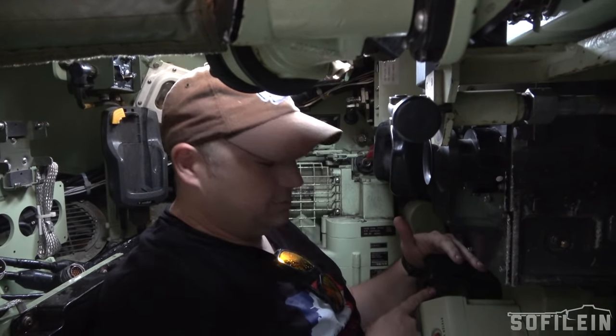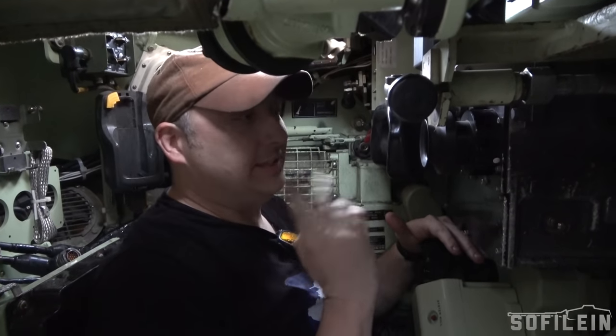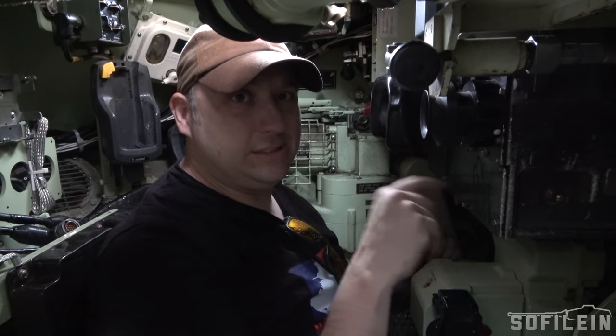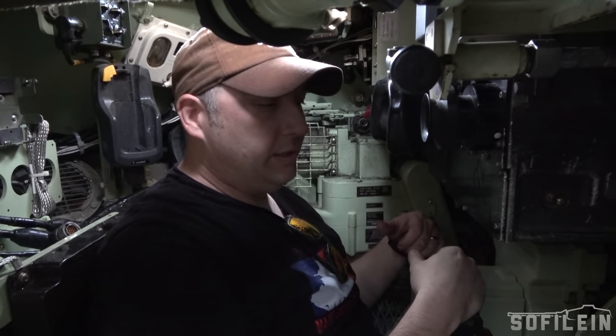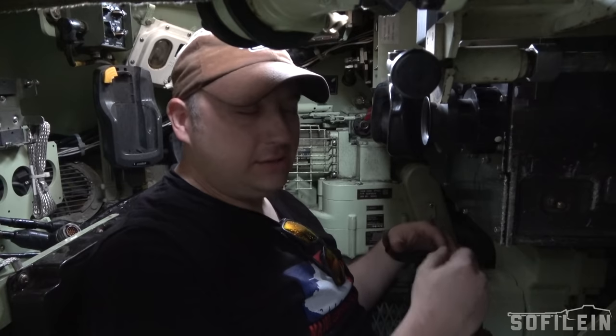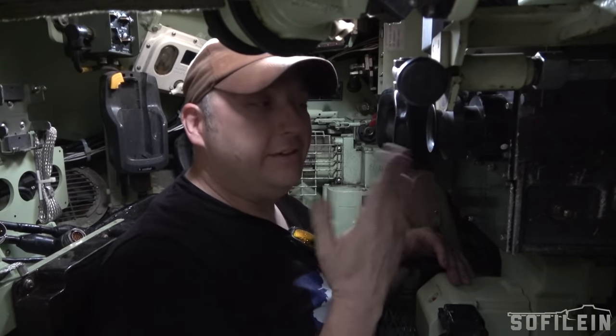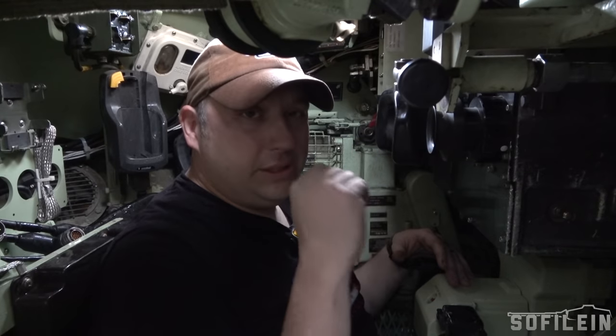Your laser button is right here. You push it, laser goes out, comes back, tells you how far the target is. That automatically puts all of your ballistic information for the ammo type selected into your system. If you're tracking a moving target, all you have to do is aim center mass, laze it, and then this will automatically input your lead and your elevation, and hopefully you'll get a first burst on target, and then you'll kill your target. Dunskies.